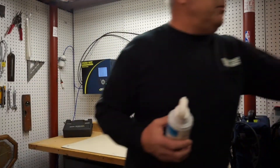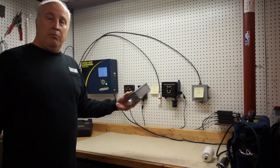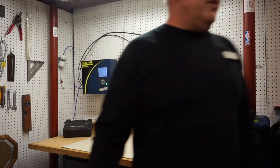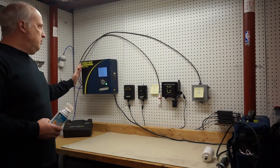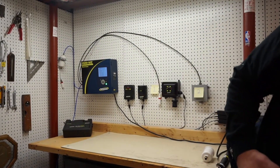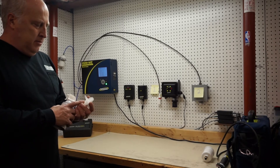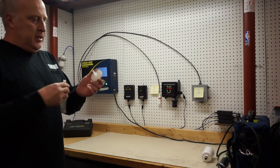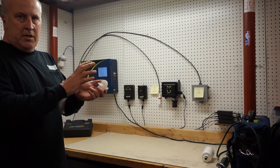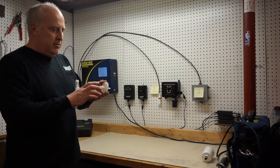I don't have one open right now, but the waterproof enclosure is basically the same thing in a watertight, gasketed box. This is great for meat prep areas or places where you're worried about equipment getting knocked into. They're very effective at extending the life of the pickup point. The last thing you want is to pull water into one of these systems. There is a filter inside — this one actually has a Gore-Tex membrane in it. It's waterproof for a while, and all the air samples flow through it as a last line of defense. If water gets in there and stops it, or if you suck in a lot of water over time, it can get through and that sensor ends up being no good. You don't want dust or dirt inside that sensor.